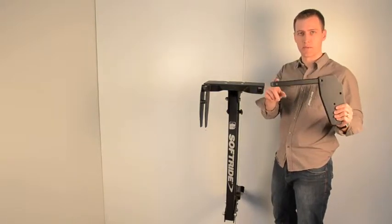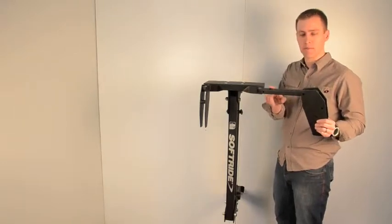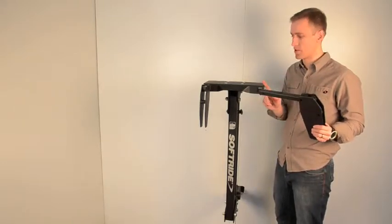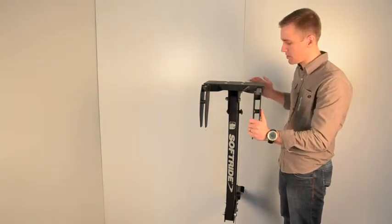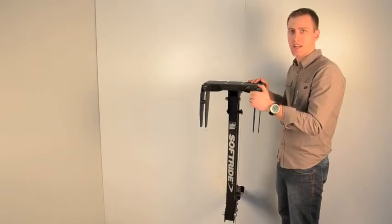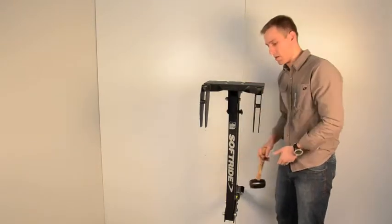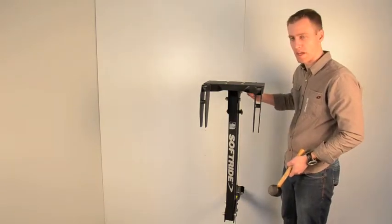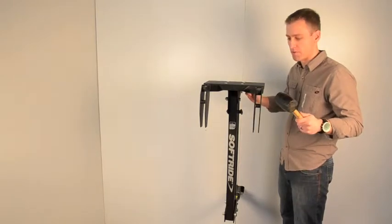We're going to install the second one-inch arm with inner pivot plates — this is part number 2A in your instruction manual. These can be a little snug the first couple of times you insert them, so it might be handy to have a rubber mallet around. Don't use a plastic mallet — you'll ding the paint up pretty good — and certainly a hammer is a no-go. Put your thumb on the trigger on the back so that you don't bash through the auto-lock, then apply some well-aimed force.